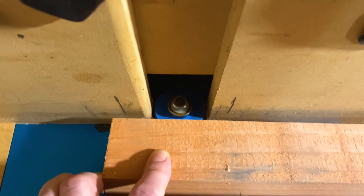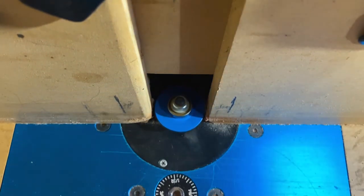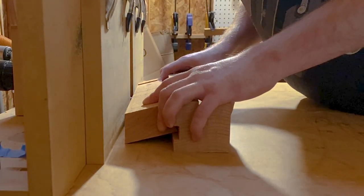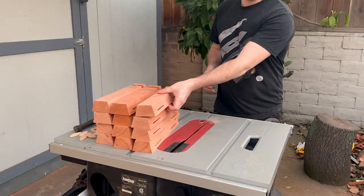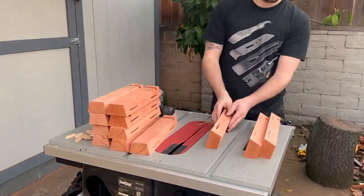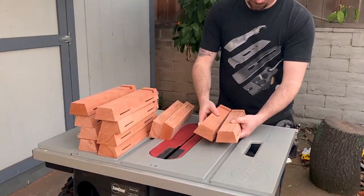While the epoxy was curing, I used a slot cutting bit on the router table to cut grooves for biscuits between each stave. Then did a test assembly. These biscuits will help keep all the pieces aligned when I glue it up.